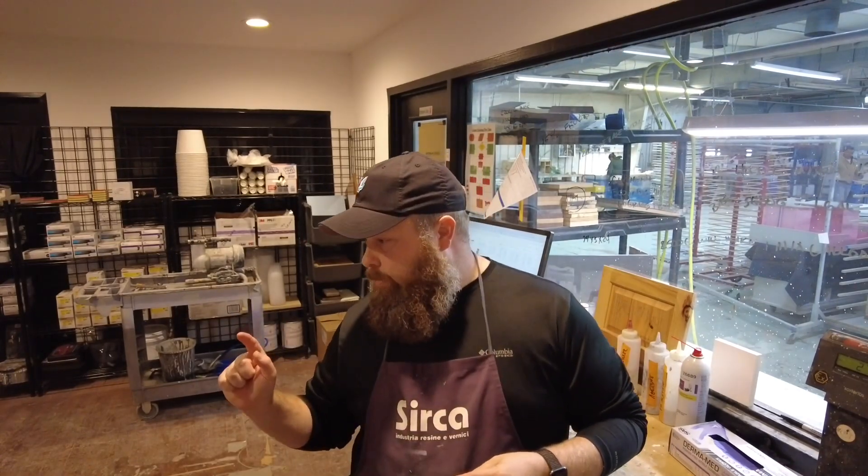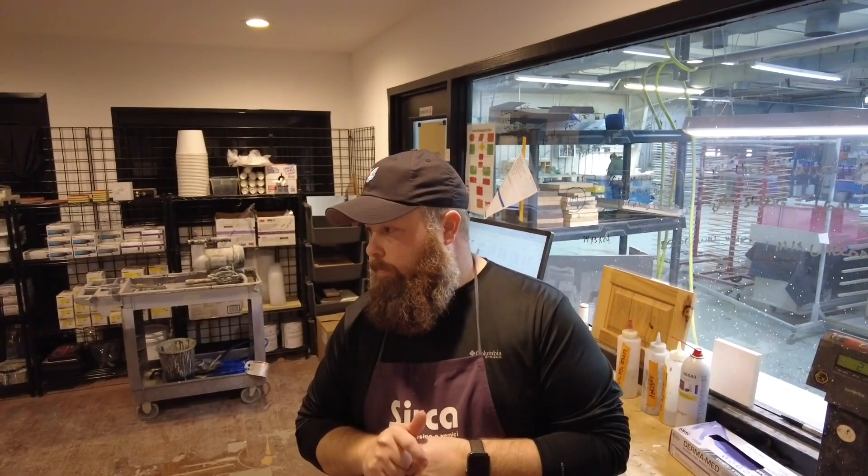What I've been working on today is trying to figure out the proper mix ratio for spraying this high gloss wet look by Circa. We're using the LPU-003 with the 6 CTH 43 hardener. We are tinting it 15% with FBU-08, which is a white solvent colorant, and we are reducing it 35% with PM acetate.